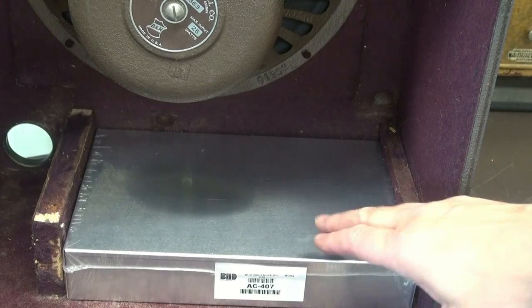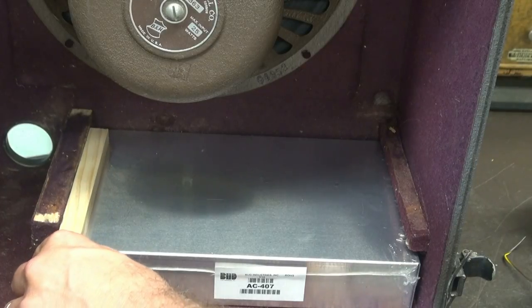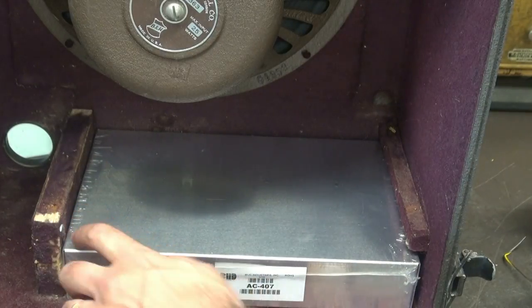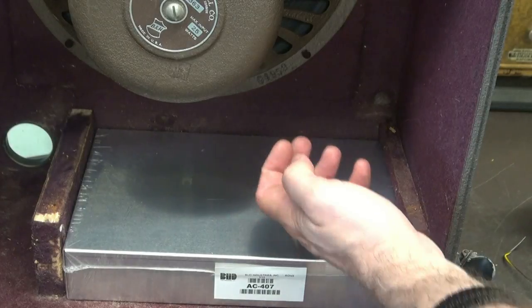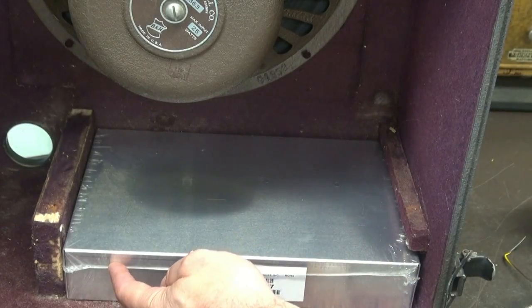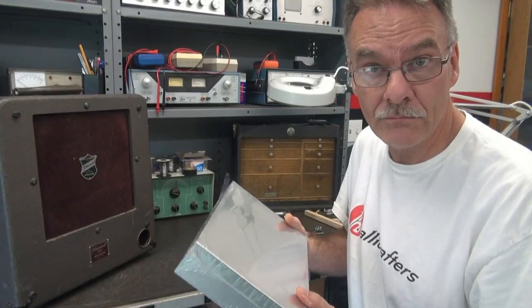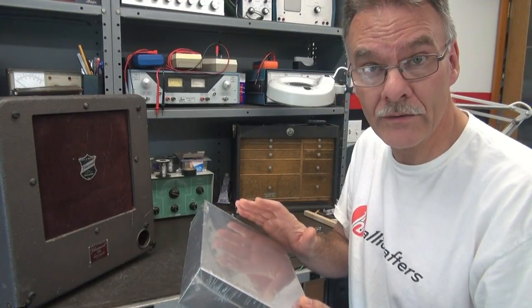When I get to the point of securing the chassis, I'm going to add some three-quarter inch blocks here and over here, and then I'll simply have some screws that go down from the top and hold this guy in place. I'm planning on the controls firing out the front, and on the rear you're going to have your AC input and your power switch. First step, I'm going to get this chassis laid out, get the holes punched for the tube sockets, transformers mounted, etc.